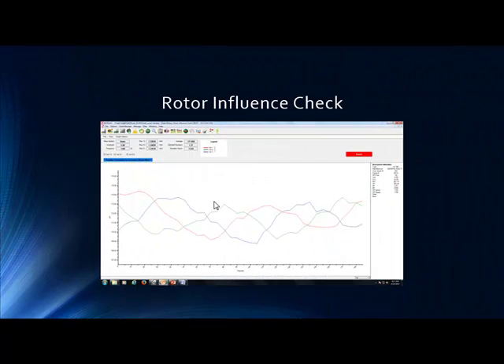So let's take a look. We did a rotor influence check. The motor is secured when we do this, and we're rotating the shaft every five-degree increment, taking inductance measurements. This allows us to strip away power and purely look at the magnetics between the rotor and the stator — indicating rotor anomalies and even a little eccentricity from the peak-to-peak variance. We're correlating online and offline data, giving us better confidence when we say we need to pull this motor.